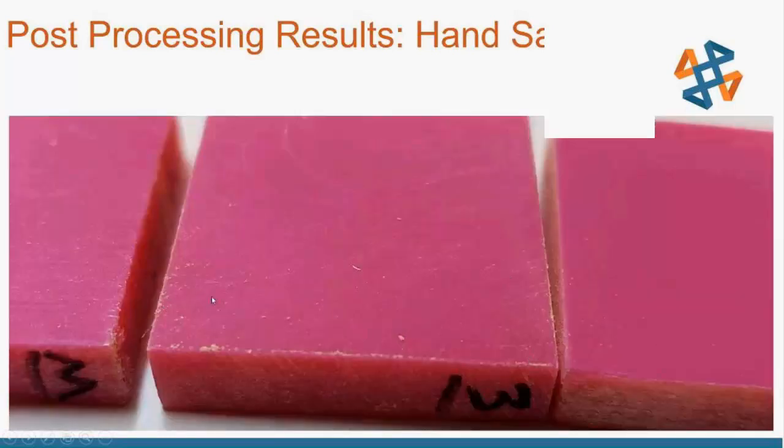You can really see those gouges on the 3. They still show up on the PolyJet a lot more than they do on the FDM. So with FDM, you can get away with just a 3 grit system, quick, down, dirty, easy. But putting in that fourth, 400 grit or better, really makes PolyJet shine.